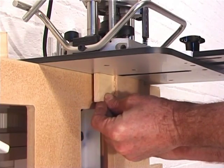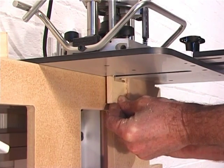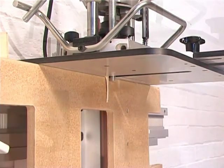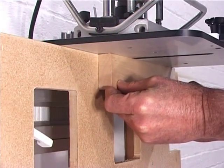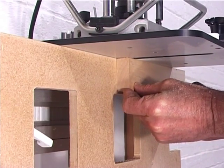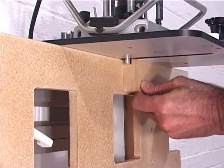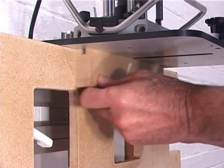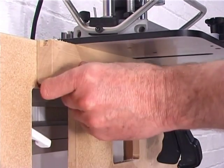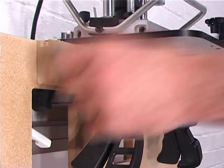The groove is to take the panel and the tenons. It goes exactly down the line of the tenons, and that locates its position. The same setting is then taken for the grooves in the stiles. And when you cramp the stiles to the mortise rail, you can drop the mortises in this exact line also.